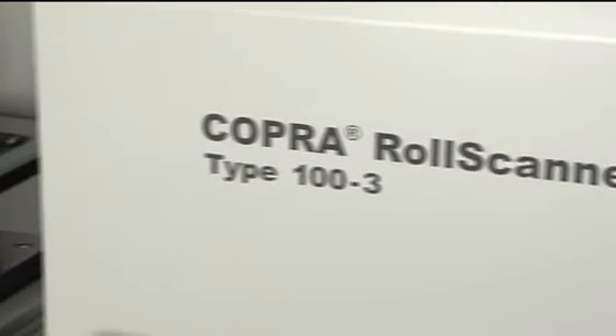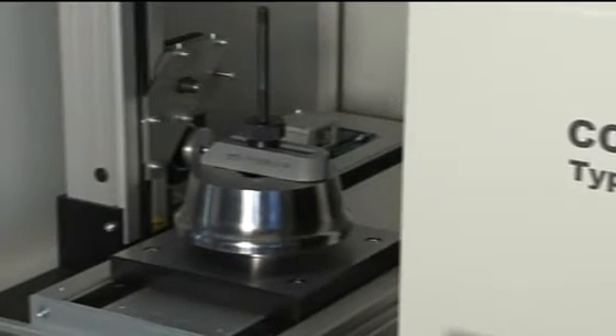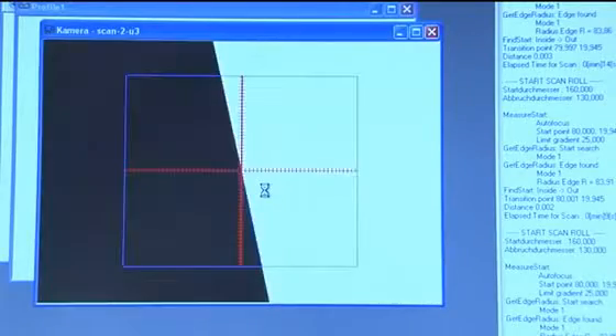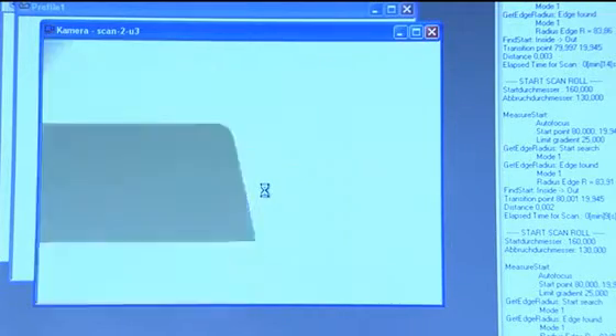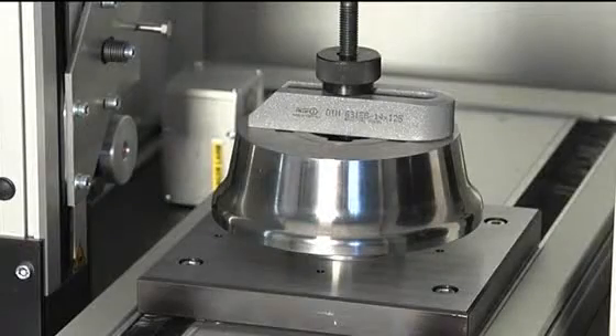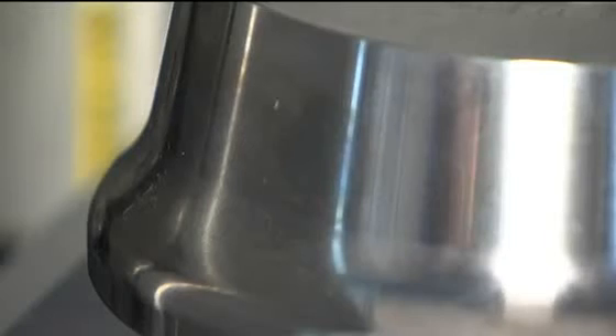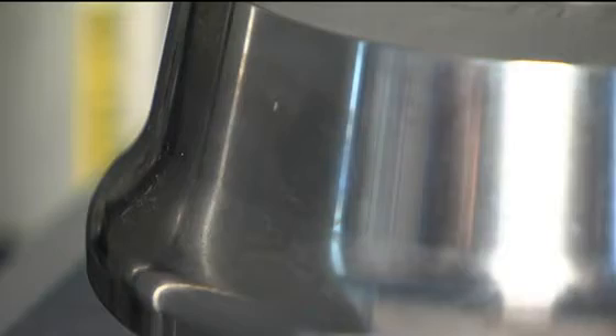One of them is the radius of the tool. It can make a difference if you are manufacturing a roll with or without radius tool compensation. If you have the wrong settings, you will have the wrong contour. In addition, you always might have a problem that you have to reprogram the roll contour. This is usually done manually by specific intersection points while following the contour. And if the operator of a machine has to do that, of course he may make a mistake — and then the manufactured roll is also wrong.